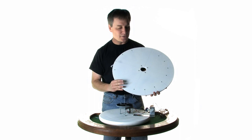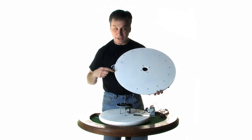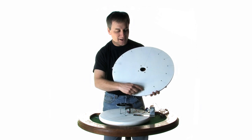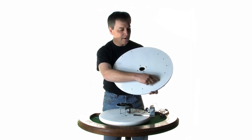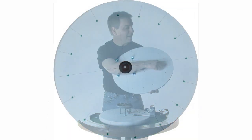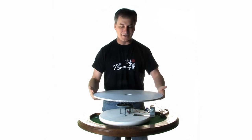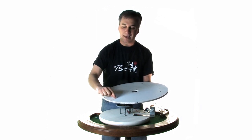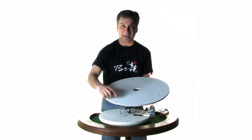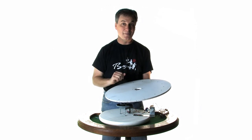For an initial animation test, after segmenting each area off, I got some dots from the stationery store. The dots are positioned in an animation sequence: the first dot starts near the top of the line, the next goes a little higher, and they continue until they're above the line, then each one goes a quarter inch lower until it reaches nearly the edge of the circle. When the disk spins and the strobe illuminates each segment, the dots should freeze in place and seem to slide up and down the markings on the edge of the disk. If we see dots bouncing up and down rather than whirling, we know the strobe is adjusted properly.